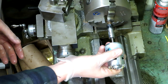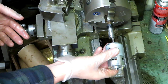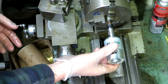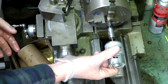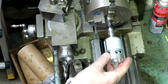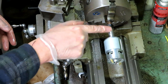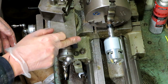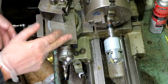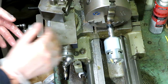The next job is to give our motor a try. I am somewhat surprised that that went on there — I think that's a good fit. I can almost feel it pressurizing as it slips on, so I don't mind that. That should be okay. The question is will any of it be running truer? The next job will be to take this out of the lathe, drill a couple of holes for our grub screws, and well — will it work or will it not? I don't know, your guess is as good as mine.